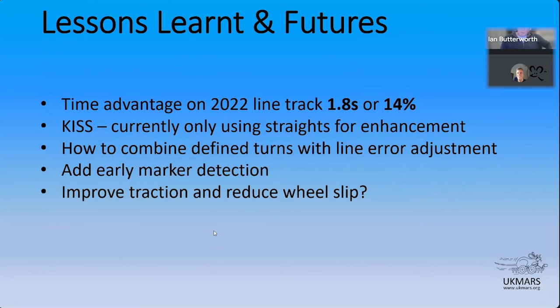If you call it lost motion, if you accelerate in a straight line and you tell your robot to put the hammer down and do 5 meters in a straight line, the harder you accelerate, the more you will fall short. That should be a common observation from all of you who've tried it. And it would be embarrassing on the drag race. Once you get beyond a certain level of acceleration, the amount of lost motion is linearly proportional to the acceleration. Strictly speaking, it's proportional to acceleration at all accelerations, and I happen to have tested this just last week. Below a certain amount, you know, 1 meter per second or whatever, you just don't notice it. But as soon as you start to get up to like 3, 4, 5 and more, you will experience lost motion, and it's pretty much linearly proportional.